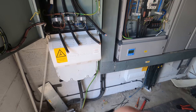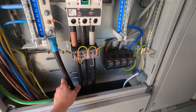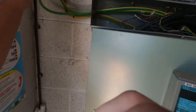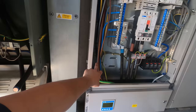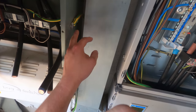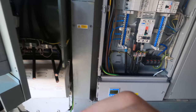That is pretty much it. It's about half twelve. Considering we didn't start until about nine, it's not too bad. Earthing's been redone as well - you've got 70mm main earth and then 70mm going to the panel. One to the panel there, and then one onto the earth bar on the inside of this trunking. And then we've got this link as well which we renewed in 70 for the meter cabinet. I'm just going to wait for the DNO and then probably outro the video.